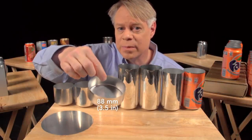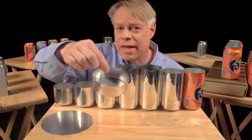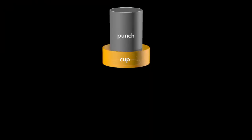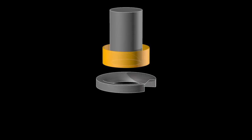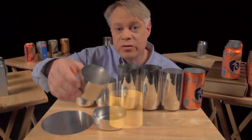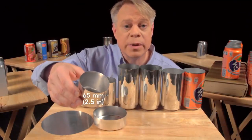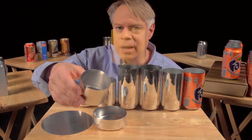This cup is about 88 millimeters in diameter, larger than the final can, so it's redrawn. That process starts with this cup and uses another cylindrical punch and a redrawing die. The punch presses the cup through the redrawing die and transforms it into a cup with a narrower diameter, which is a bit taller. This redrawn cup is now the final diameter of the can: 65 millimeters.